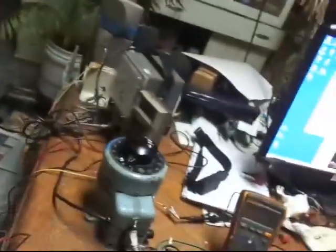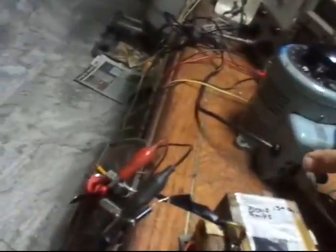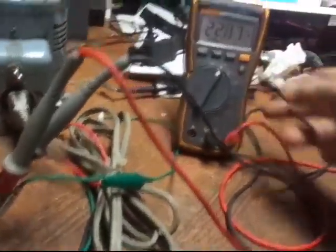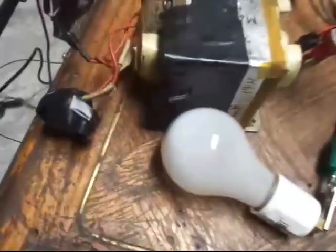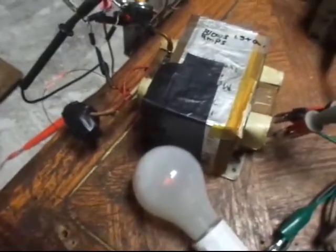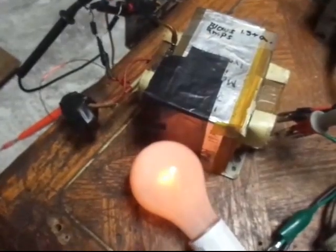2142 hours of 324. Picking up where I left off. We'll take this off. Turn that. Turn this. Volts going in to the transformer. The 100-watt bulb is a safety feature, you could call it. It's a current limiter.